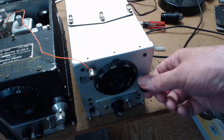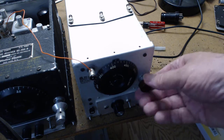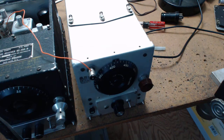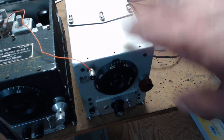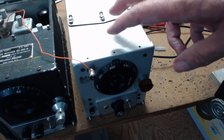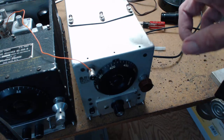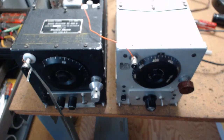This has to be at 415 kHz, and then this gets converted down. At night you can listen to the hams - if you've got code, instead of hearing three code stations at once you only hear one. That's why you want to be more narrow and more selective. It's one thing to pick the station up, it's another thing to separate it from something that's close by - sensitivity versus selectivity. Be very careful when you buy on eBay.